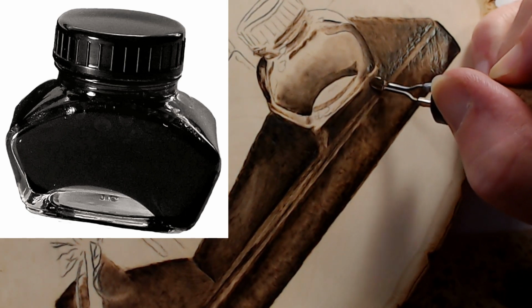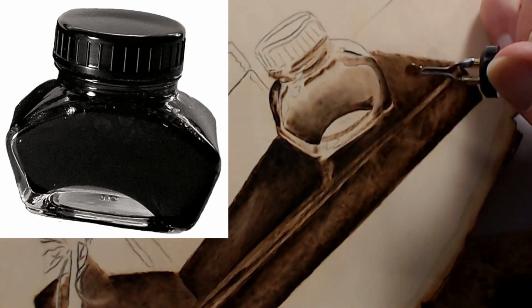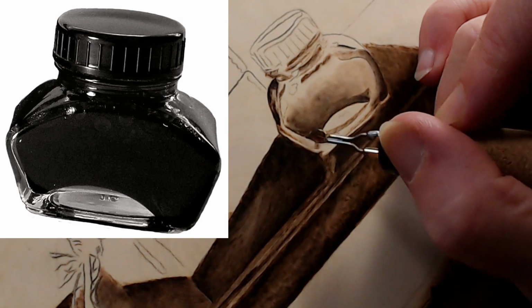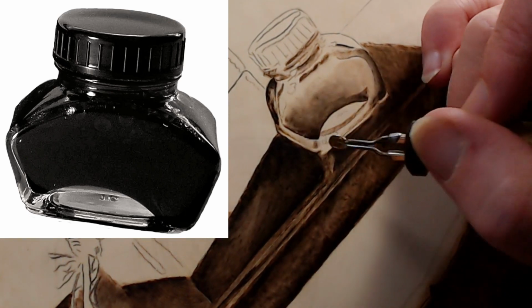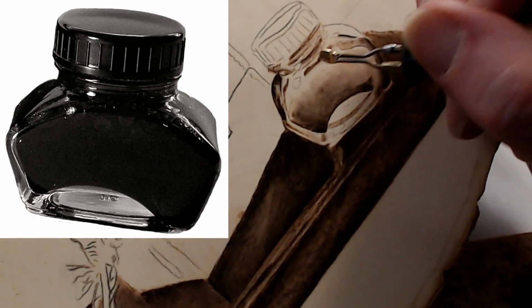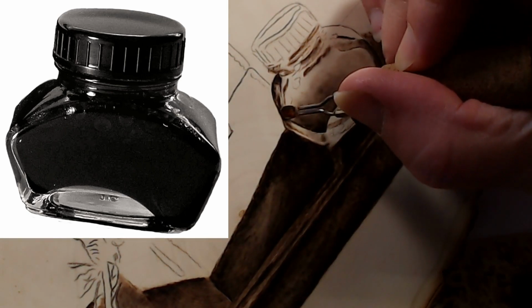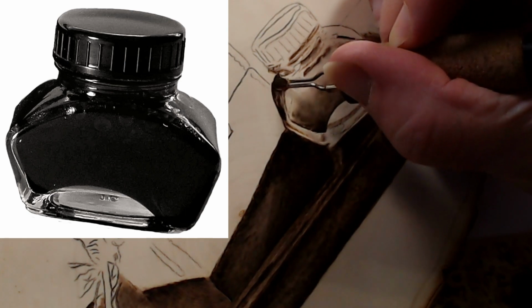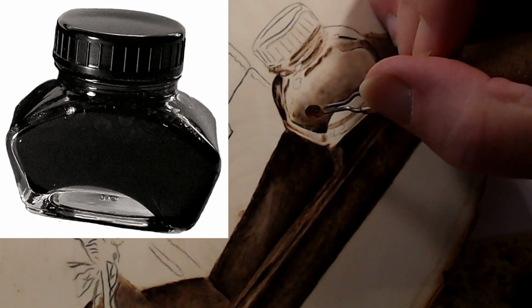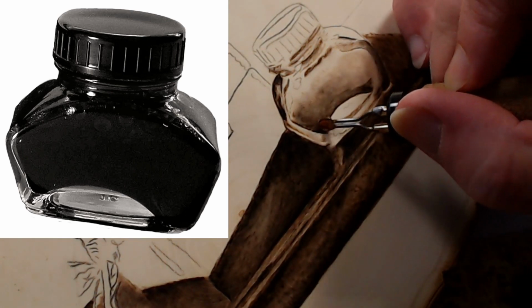You can do it. Just take your time and work up to it slowly, meaning burn further out and work your way closer to the line. That way you have some wiggle room. Yeah. And it's easier to adjust versus if you go right up to the line and try to get it right then and there.